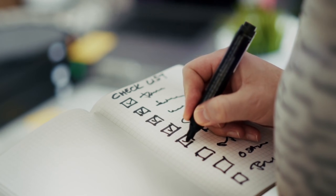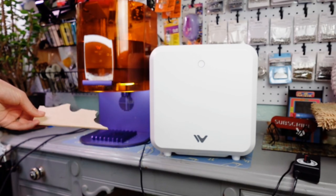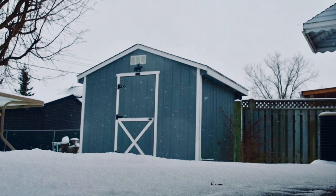Location, location, location. Let's blow through these laser setup basics before we dive into some fun ideas of what you can make with your new laser. There are a bunch of different lasers out there, but the requirements are all pretty similar. Not ventilating the fumes your laser will be creating is the number one mistake newbies make. When you are cutting or engraving anything at all, it creates smoke and fumes, so you need a plan. Find a place for your laser by a window for an exhaust hose to go through, or use a filtration system. When picking the place you can vent your laser out to, consider the temperature of the location as well. Lasers such as water-cooled CO2 lasers and diode lasers don't like freezing temperatures. If you put one in an uninsulated garage or shed with occasional freezing temperatures, you could crack your CO2 tube and have performance issues with cutting and engraving.